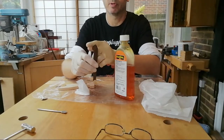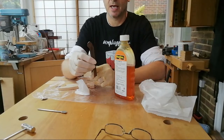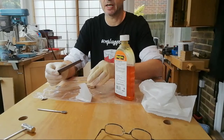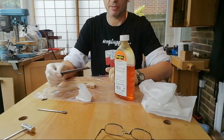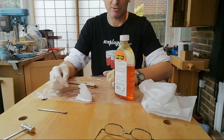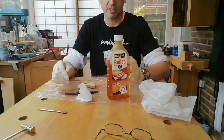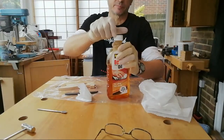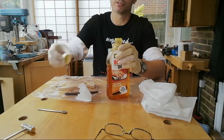I've just finished off a little bit of shaping on the end there and that's all ready to go. I tested it again — it's still working, thank goodness. So now I'm going to finish it. I'm going to use boiled linseed oil and give it a couple of coats, so I'll just show you one of those coats here today.